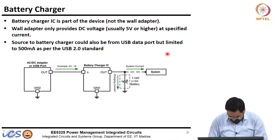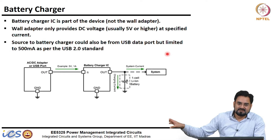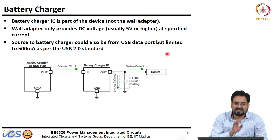Battery charger. Most of the time, 90 percent of people will say 'where is my phone charger?' and refer to that wall adapter — but that is not the charger actually. That is simply an AC to DC converter which takes your 220 volt main supply and converts it to 5 volt USB standard. That is not charging your phone; it is supplying 5 volt to the phone, from where your battery is getting charged. The charger is sitting inside your phone.